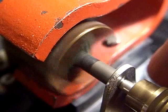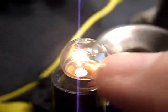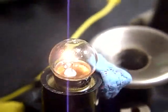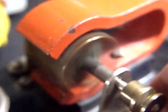Notice it runs slower. We had it set for about 4 volts; the lamp is dropping about 2.5 volts, so there's not as much pressure left to push the current through the motor. It's like a restriction in a garden hose — if you put a kink in the hose, it's going to cut down the speed of a sprinkler. Now, what happens when I put a load on the motor? Let's see what happens to the bulb's brightness — it should increase. I'll give it more juice, more pressure, and take it up to 5 volts. Now the motor has plenty of current because the voltage pressure is high enough to overcome the resistance. The bulb should get even brighter when I load the motor — indeed it does.